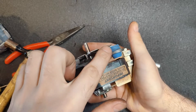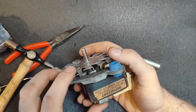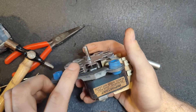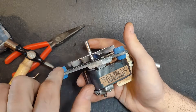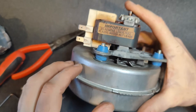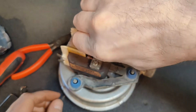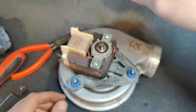You can see what I mean by wobble. What I want to do is straighten out as much of that as possible. It doesn't have to be absolutely perfect because it's very lightweight — it won't actually cause much of an imbalance. But you want it to be nice and tight on the shaft and also reasonably straight, because we don't want it to rub off the housing as it's spinning. Still reassembling, but I now have the spring in here on the rubber foot and the allen key back in. We can give it a little test spin and just make sure nothing rubs. You can see it spins freely and keeps a lot of momentum — that's a good indication that the bearings are working nicely in there.